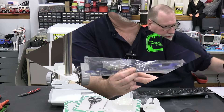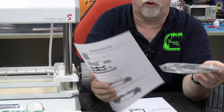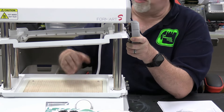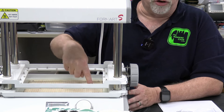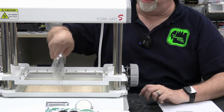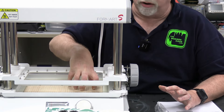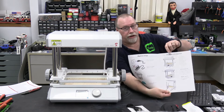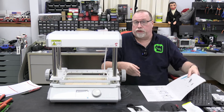Now we'll move on to the instructions. Here are those metal pieces from the accessory box. There are some bars that fit across the top of here where your plastic goes. If you're doing two different pulls, you increase your risk of getting those rafts or creases. By putting these pieces in here, you're basically taking this one big bed and making it into two beds — so you're pulling here and pulling here separately. You don't have to worry about a cross-vacuum creating those rafts. The first thing the instructions tell us to do is install the hood and some wiring, but mine already came assembled, so we're good.